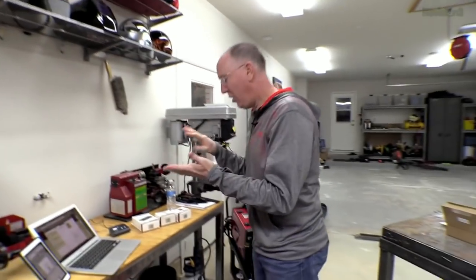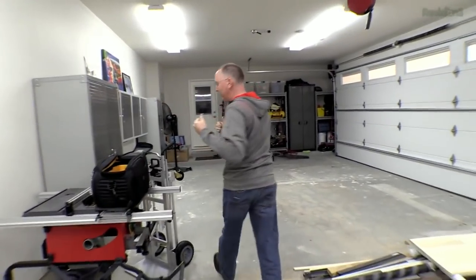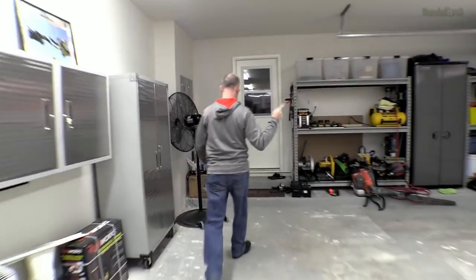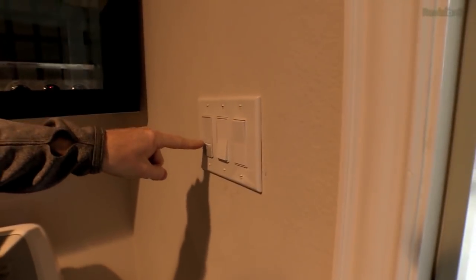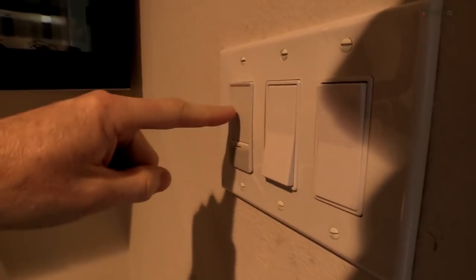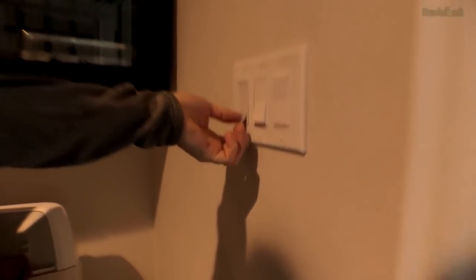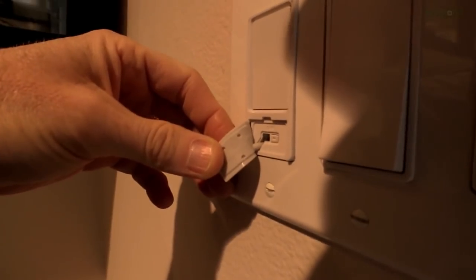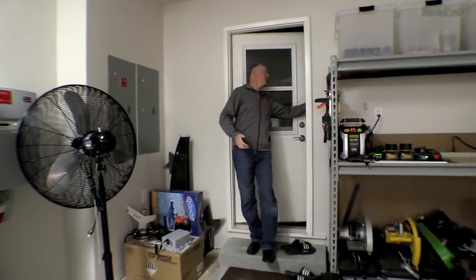You can do all of this with the Android app, the web interface, or the iOS app. To make the lights turn on and off remotely, inside where our light switches are we replaced one light switch with a little LiftMaster light switch — on and off, it works just like the others. Right under it there is a learn button, and that's how we taught it to use the remotes the same way as the garage doors do.